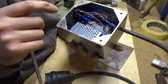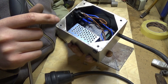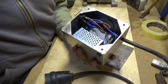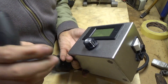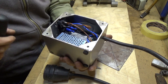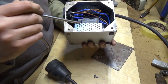This here is the module that controls the output power. It drops voltage and current to reduce motor speed, for example, or to dim some lights, and this is rated up to two and a half kilowatts or 2500 watts. This unit here is the display itself, and this display has an integrated voltmeter, ammeter, and calculates the power and energy used by the device.